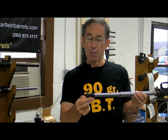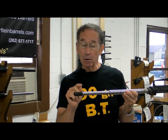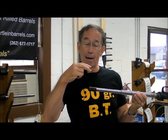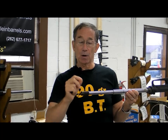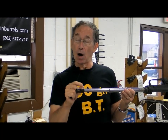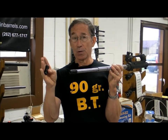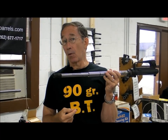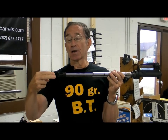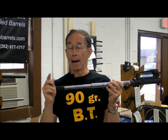So, if I have a flash suppressor in its current position, which is normal, and I unscrew the flash suppressor, put on an extra peel washer, and screw the flash suppressor back, that moves the position of the flash suppressor to one o'clock on a 12-hour clock face. On the other hand, if I spin the flash suppressor off and remove a peel washer, that will time the flash suppressor back to 11 o'clock instead. So if we start with the flash suppressor in a 12 o'clock position, we shoot groups with known lots of ammunition and keep those groups, then we spin the flash suppressor off, add one peel washer, and screw the flash suppressor back — it will now be timed to one o'clock. We repeat the shooting with the same lots of ammo and compare the groups.